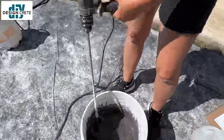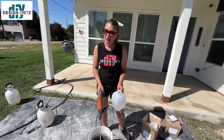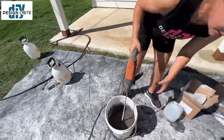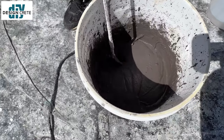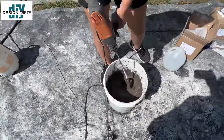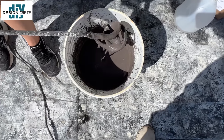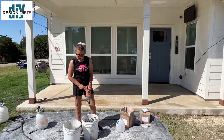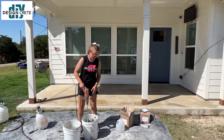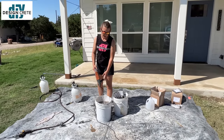It's been five minutes. You'll notice it's much thicker when you come back. That is way too thick, so now we can adjust and add more water — a little bit at a time, because a little bit of water makes a big difference. Now see how it's not really sticking to the paddle and it's dripping off? That looks just about right. A helpful tip: have an extra bucket filled with water so that when you're done you stick your drill in, spin it, and it comes out clean.